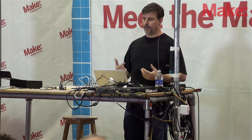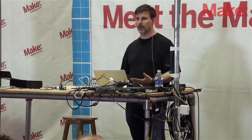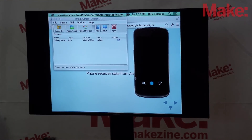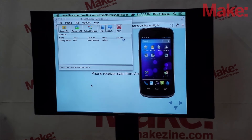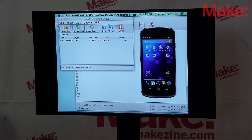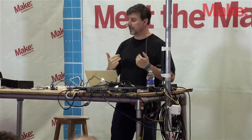I do a lot of work with mobile phones, and PhoneGap is a platform that lets me write native mobile apps with HTML and JavaScript. I wrote a plug-in for that — my demos use this plug-in that lets us do Bluetooth serial from Arduino. I have software which mirrors my phone, and we disconnect CoolTerm and launch this program. It connects and then it's receiving that data — now receiving it using JavaScript and displaying it in a native Android app. From the Arduino side, all we need to do is set up that serial connection and write the data, and similarly we can read the data in.